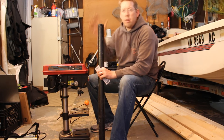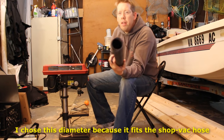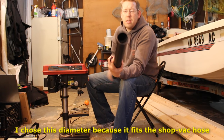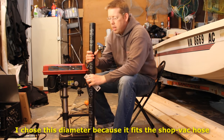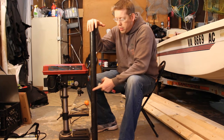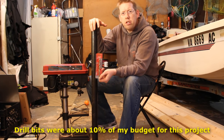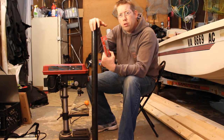The first step of my forge project is to put holes in this pipe. This is a two-inch heavy gauge black steel pipe — heavy duty stuff, about a three-foot section that was a scrap from the plumbing section at Home Depot. I've got to put some holes along the edge, so this is pretty heavy duty drilling. I've got a half-inch Milwaukee cobalt drill bit designed for drilling through metal.